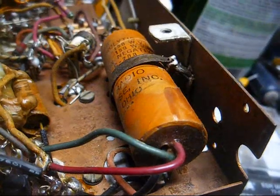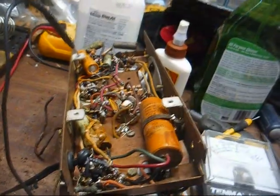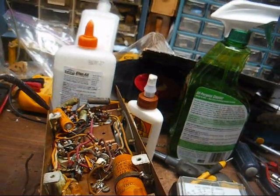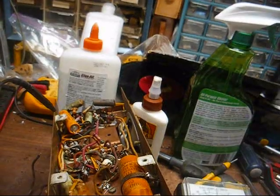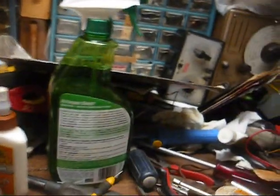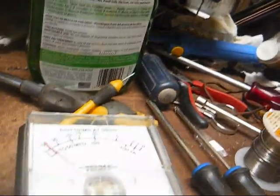Well, I got the power cord replaced. I'm checking the filter capacitor. But yeah, my phone's just like Jordan Peer's phone. In fact, I've watched his videos and heard his phone ring in the background and thought it was my phone ringing. But anyway, checking the ESR of the original filter capacitor, that's section 1.